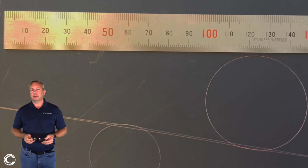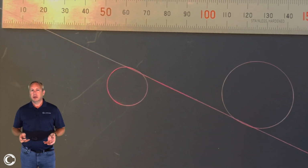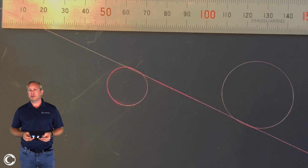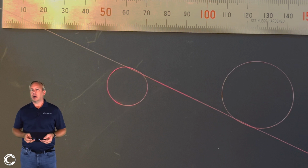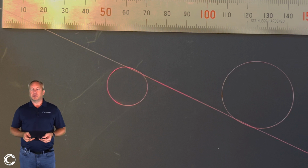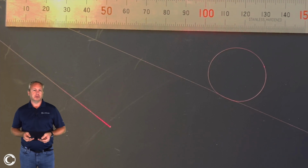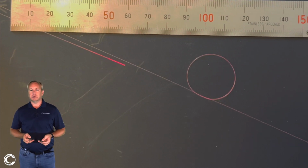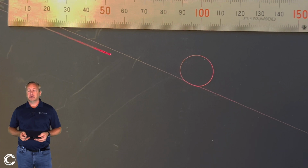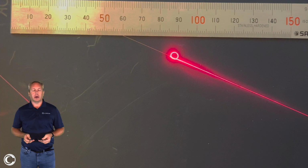This video clip demonstrates the bend tolerance of traditional fibre compared to that of SSF fibre. You can see here that both fibres have had all of their buffer coatings removed, and we're looking at the 125 micron cladding layer. In the case of the SSF fibre, the 125 micron diameter obviously includes the polymer. As the fibres are pulled simultaneously and the loop becomes smaller, the traditional fibre breaks at around 15 mm per the manufacturer's specifications. SSF fibre, however, continues its tolerance for bending until around 2.5 mm per Cleerline specifications.